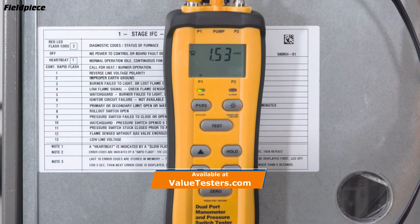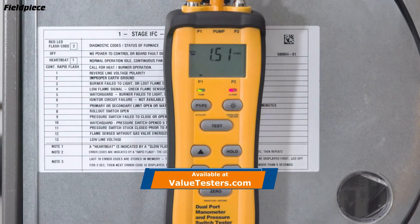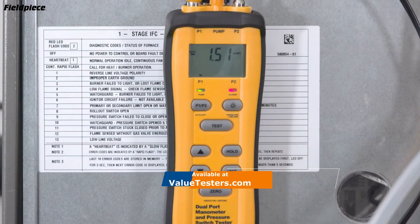Boom. Now just to be sure, back it up a little bit to get it to close, turning on the red LED. Bam. Now your pressure switch is set to 1.5 inches of water column.